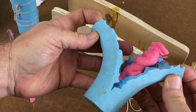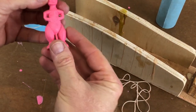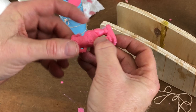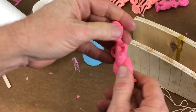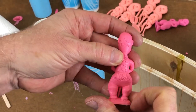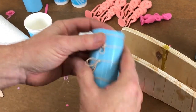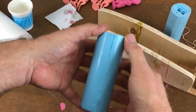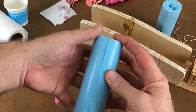Same on the other side — you can hardly see it. Let's pull this bad boy out of here. Just absolutely a perfect casting. Very minimal flash — look how little flash there is on that. You can almost just brush it off with your fingers, so thin and so fine. Hardly leaves a line at all — just the barest little indication of a parting line. And that is why I love cut molds. I'm a cut mold guy, I'm a cut mold fan. Let's do this one. Notice the parting line — you think it's this seam, but that's just the mold case seam, it has nothing to do with the mold. Let's find the parting line — I don't even know where it is.